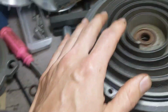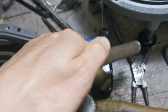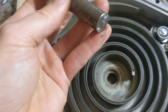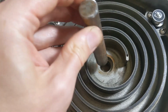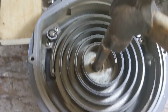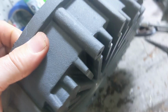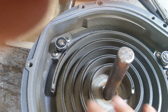This is mirrored with this one as well, so it's twice that this can work. I got my pin here. It just so happens, this is an imperial measurement. It might be half inch, I don't remember. But the point is, it just barely clears in there, but does not clear the bearing. And this is where I can use a hammer. The only time I can use a hammer. Because the reason is, underneath it's rough kind of material, and I'm staying away from the working surfaces.